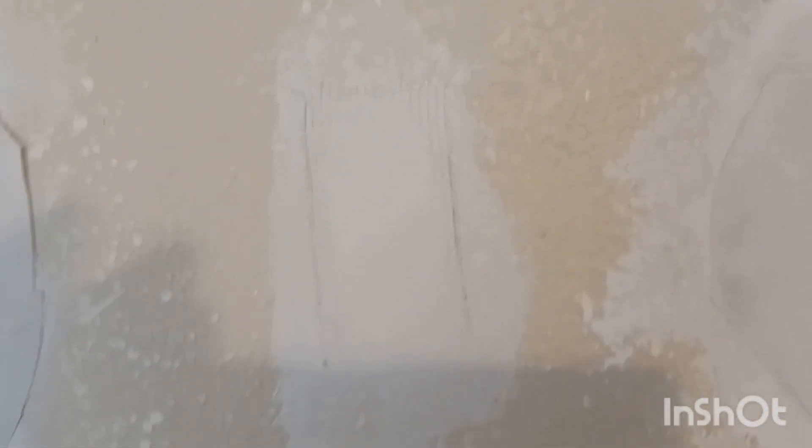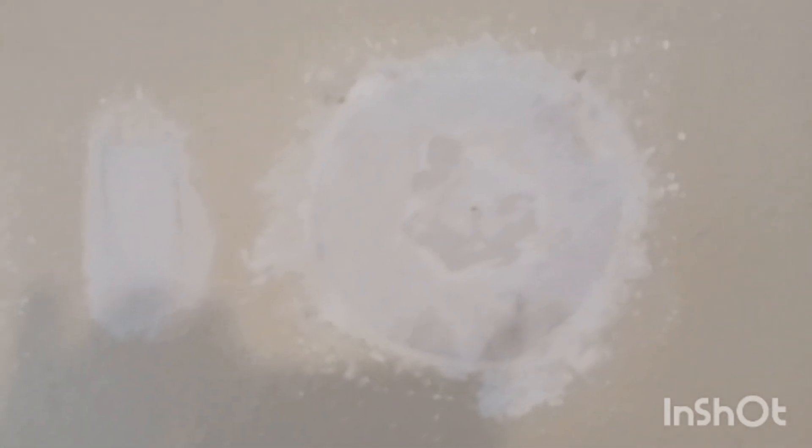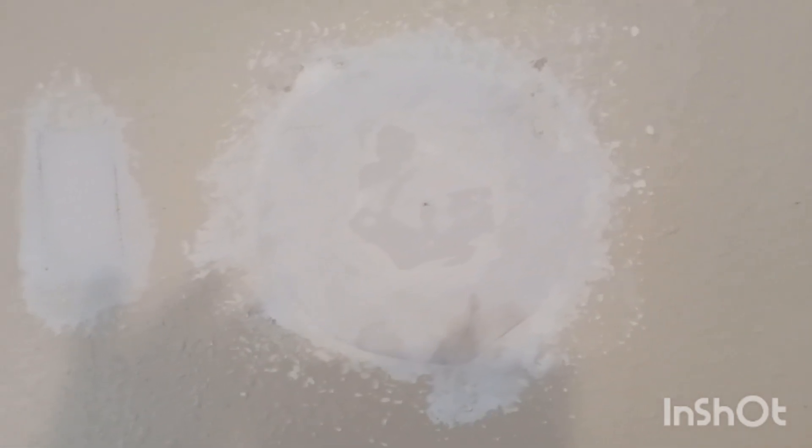Right here I've got a quick little patch job — I've got the mesh tape, and that stuff works wonderfully for cracks and stuff like this. I'll take the excess and use it on there. Right next to it, I've already done a couple of holes, and this one you can see what it's supposed to look like when it's all nice and done. We'll give it another coat.